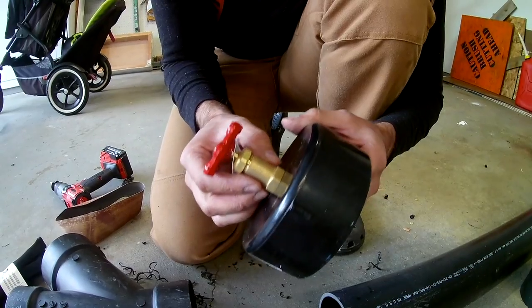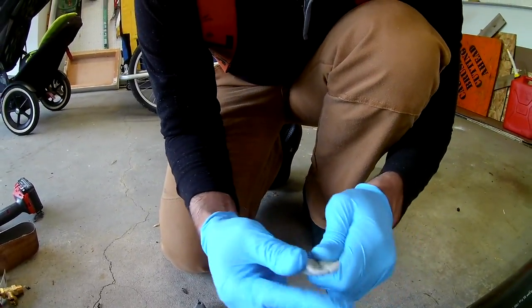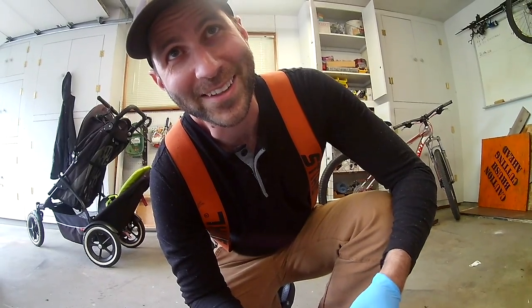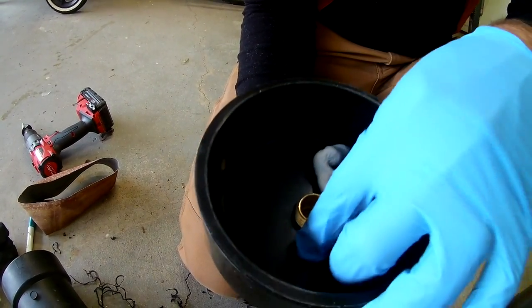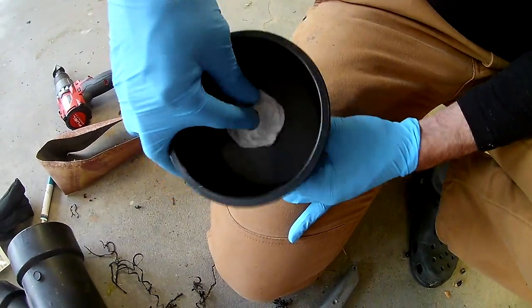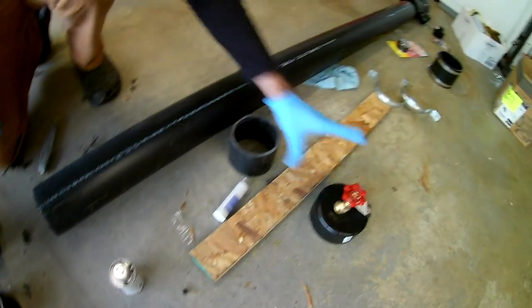You don't want your hole any bigger than it has to be — just big enough for the boiler drain to fit in there. Here's that two-part epoxy putty, actually called Marine Weld. Make sure you wear gloves so it doesn't get on your skin. Once you feel it warming up, you know it's activating and it's ready to apply. Once the putty is activated, pack it around the backside of the boiler drain — really press it in and get it into all the nooks and crannies. Let it sit before starting on the top side so you don't ruin the bond forming on the other side.